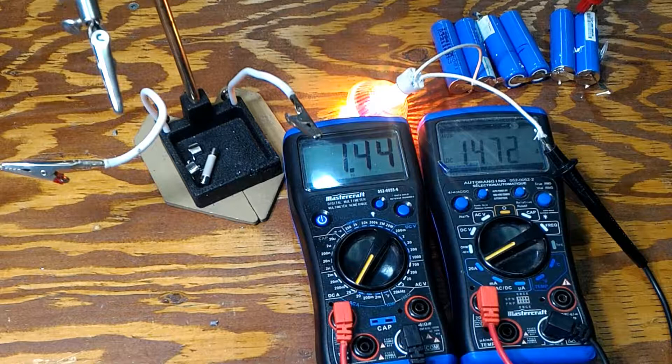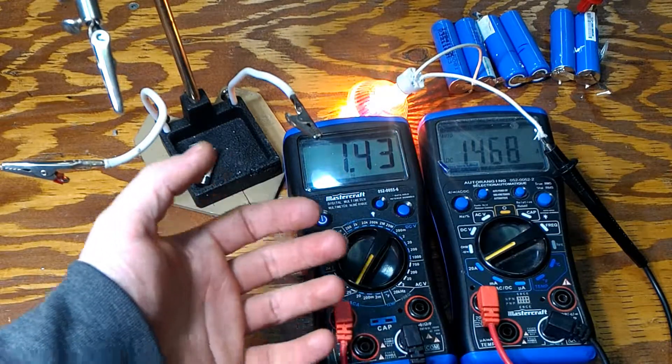As a conclusion, it's really important that you understand what I did to my meter. This modification will make your meter safer, and that is essential if you are measuring AC or DC loads of more than 5 amps — I would recommend it. The fuse and protection they have in these cheap meters is just not good — it's horrible. This is an easy mod you can do to really save your life if you're holding the thing in your hand.